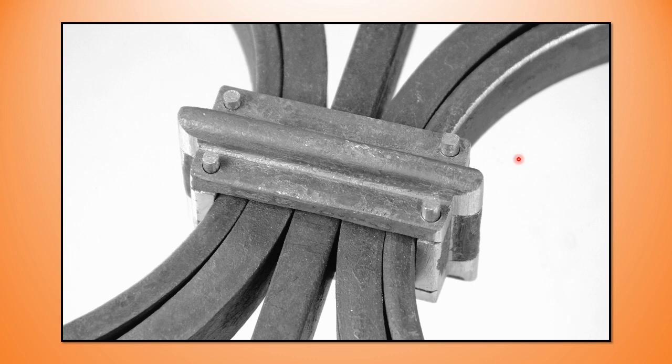Once you've got all your filing done and the front and the rear pieces matched, then it's time to take everything that you've filed to the fire. Just bring it up to a scaling heat and turn those nice shiny surfaces to a black heat so everything matches. And then you're ready to rivet up the collar.